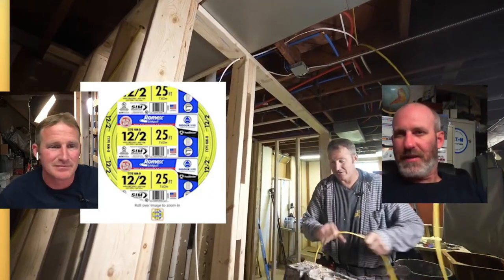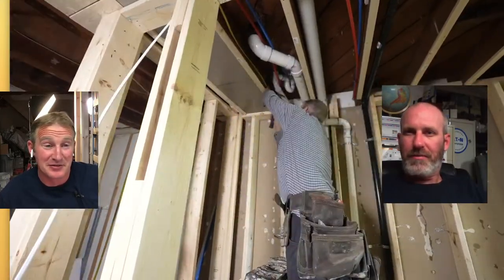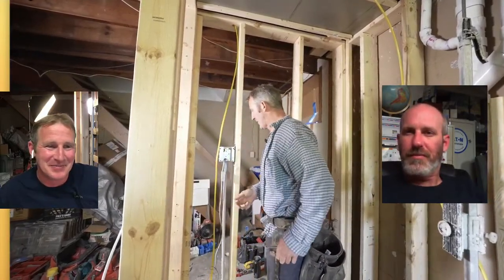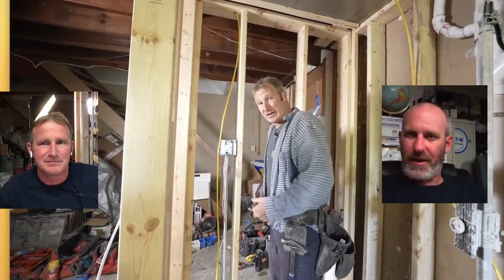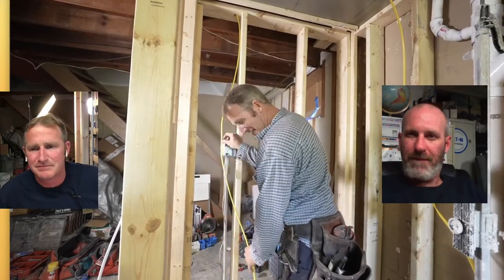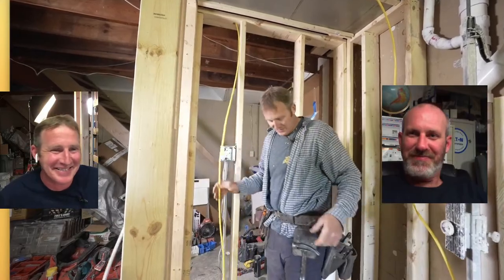This dedicated line runs all the way to the panel, and this one is for our heated flooring — you always need a dedicated circuit for anything heated. We're also using conduit stubbed down to a metal box. The vent fan with a heat element also has to be dedicated. We'll have a dedicated circuit for the GFI as well. So we have one 15-amp and two 20-amp lines for this bathroom.